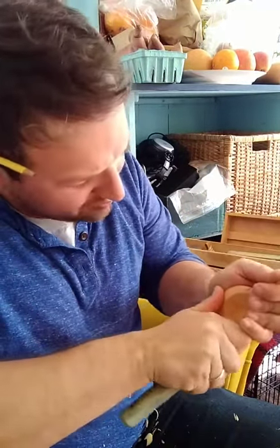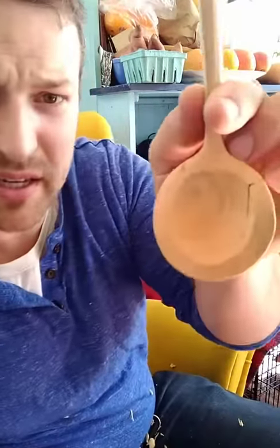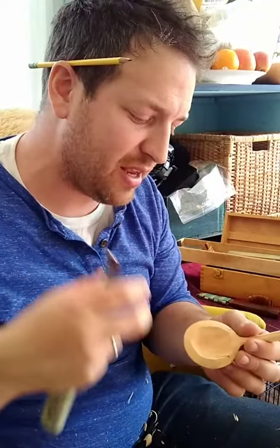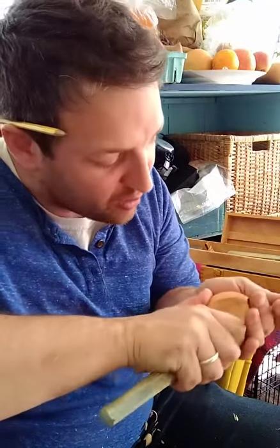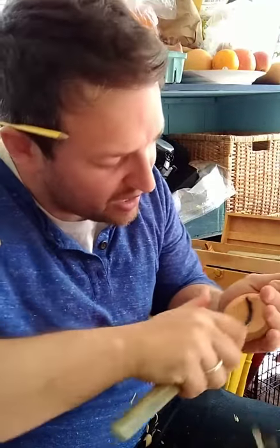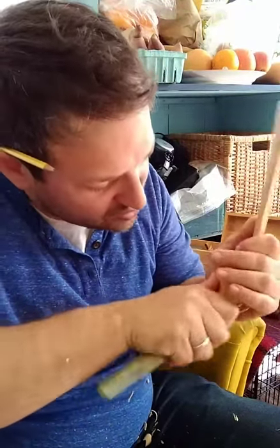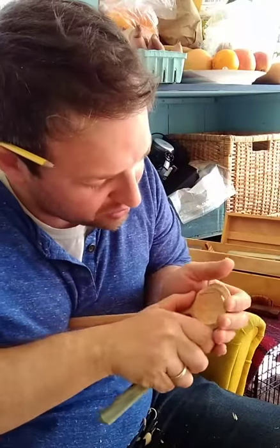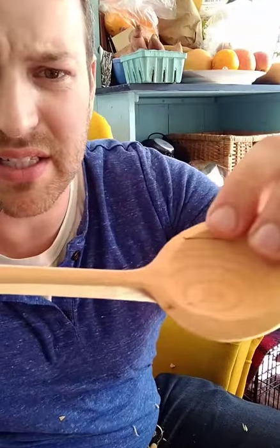The trick is to stay away from the edge and carve in a way that you're not going to hurt your body. It doesn't take very long to get going. I'm spiraling my way deeper and wider, and ideally I reach depth and rim edge at about the same time. I'm pretty aggressive here, and then I can back off and get nice finishing cuts a little bit later. As long as you're not carving super green wood or wood that's got grit cells in it — sometimes birch, cherry, or walnut can have it — this is very smooth cherry right now. But right here is a little grit cell — these little streaks, almost like a mineral deposit within the wood.